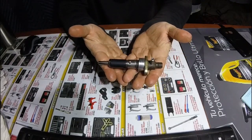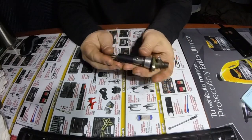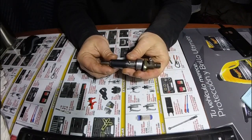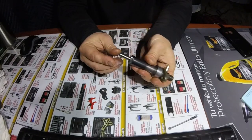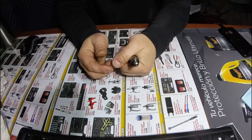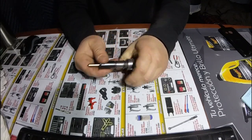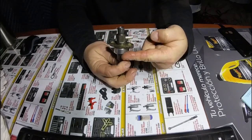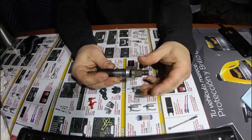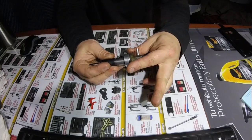So this is a mechanical diesel injector. A lot of them look like this — as far as direct injectors go, they look a lot like this. A few different ones I've seen end up looking the same way. The business end is right here, and that's generally going to be the same with this style of injector. This part is basically what is different on the Yanmar, because this is where it interfaces with the cylinder head, the plumbing, and the way it attaches.